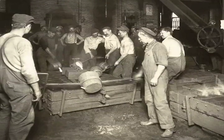This is another one of the pouring of the iron, showing the double bucket guy. Over on the right you can see the steam coming from the one they just poured. You can see the clamps on the mold on both of them that held the cope and the drag, as they're called, together while the iron was poured.